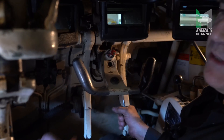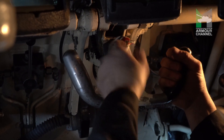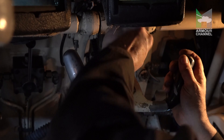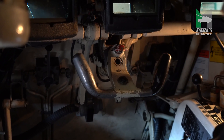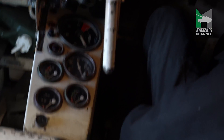What you have here, common to all Leopards, is your two parking brake levers that act on both tracks, your steering column, and the locking mechanism. With the transmissions on these tanks, if you disengage this and put it in neutral and turn the steering column, the tank would turn on itself — it will lock one track and transfer the power to the other. So once you start the tank, before you attempt to move, you need this secured. You also have the gas pedal, which can also switch off the engine by pulling on it, and the big pedal here is your brake. On this side you have the locking mechanism for the dozer blade — if you lose hydraulic pressure, this prevents the blade from dropping while you're driving, which is not fun.